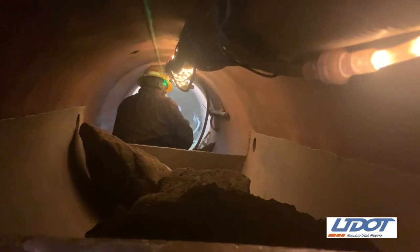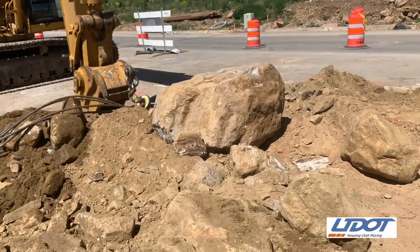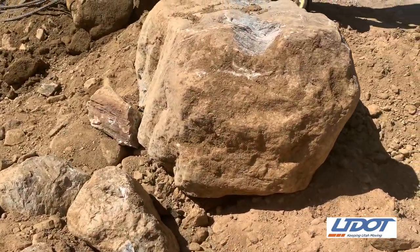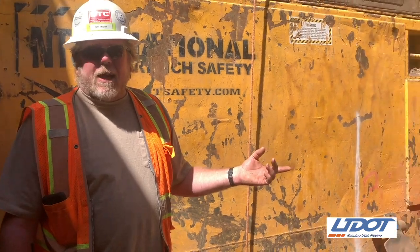We're doing a hand tunnel for a sewer line. The reason we're doing a hand tunnel is because of the large rocks that are in our way — you can't drill through them and keep on grade. We're going to go under an aqueduct out there that's 78 inches. You can't have any vibration under it, so this is the safest, most accurate way for us to go, right up to the very face with a jackhammer.